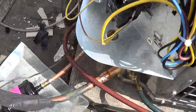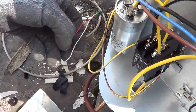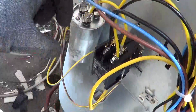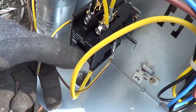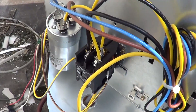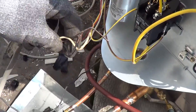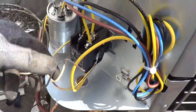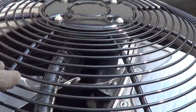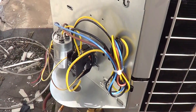The wiring on these units is real simple. There are two wires for the control — this makes 24 volts and it pulls in the contactor, which then turns on the power. The 230-volt power goes across the contactor and gives 230 volts to the fan and the compressor. And that's it on the wiring.